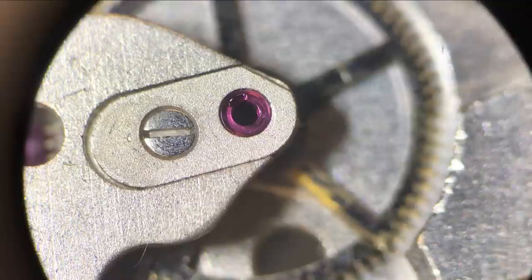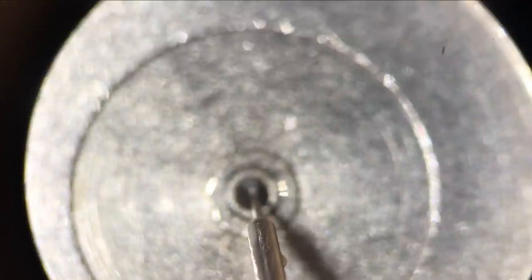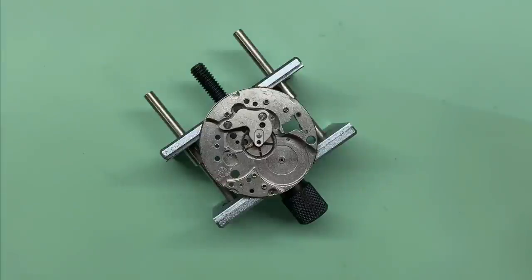for the fourth wheel. And then while we're here, I'm also going to put some grease, some Molykote DX. Just excuse me while I get it ready. On the barrel arbor, which is just over here. So might as well prep this hole as well. And I've got far too much on my oil after all of that. So okay, so now we've oiled the arbor.